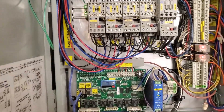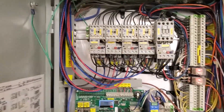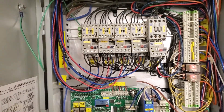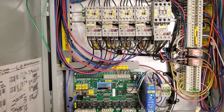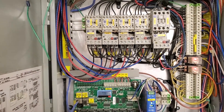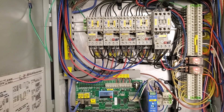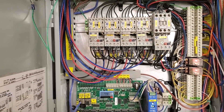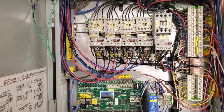I have a hunch. I'm wondering if — because they told me they had a power outage — I'm not seeing anything wrong. I did find some loose belts, and I'm going to replace those and get them going. But they were saying that the hoods were turning themselves on and off. I'm going to call and verify with Captive Air's tech support. But if they had a power outage and they didn't turn the hoods back on — this is my theory, I don't know if this is true.